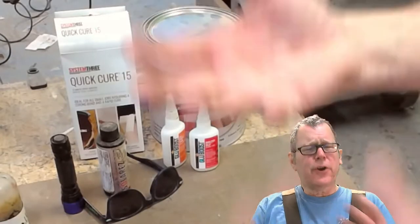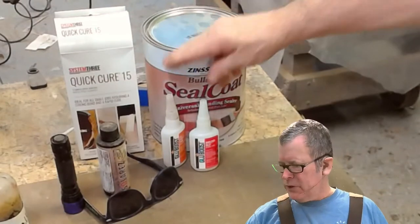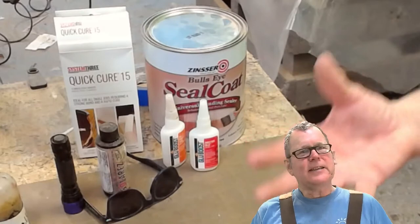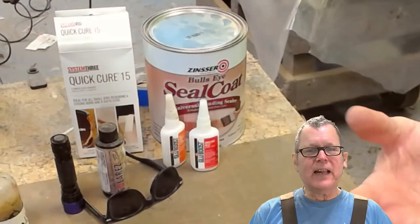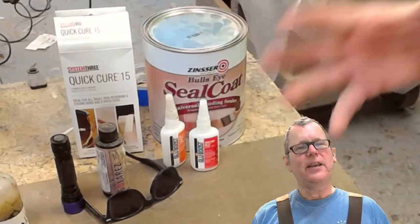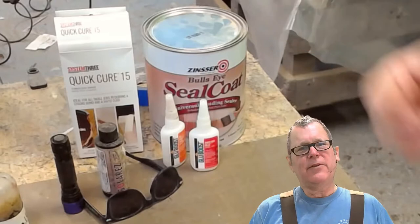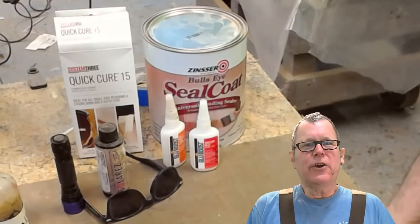To seal your void or your groove, you can use a variety of resins. You can use shellac, CA or cyanoacrylate glue, epoxies are great, and even a UV cure sealer. I just like to work a lot faster — I prefer the UV cure because it's a high solids. You can get it in one coat where some of these other products might take two or three coats. You want to be sure that any open pore is really sealed well. Maple maybe only needs one coat, but if you have an open pore like oak or ash, you're really going to want to give it a good coat.